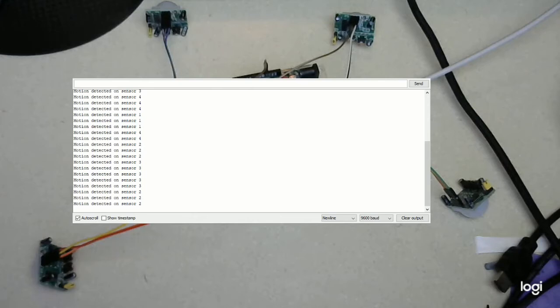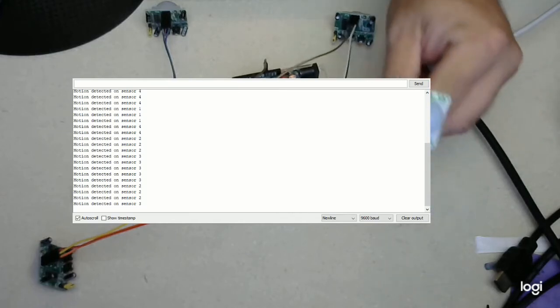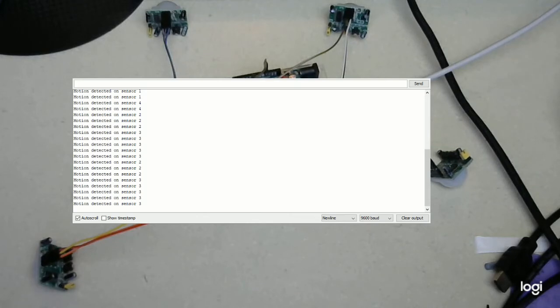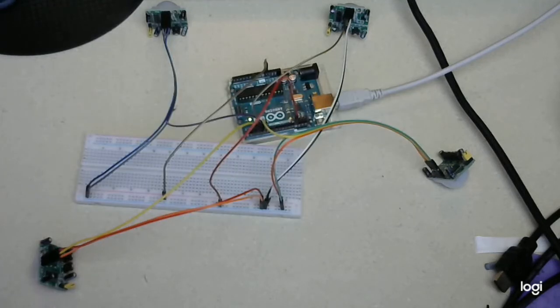And of course, when this is being actually mounted in, we'll have each location where we're detecting the beanbag be more controlled, so we don't get a lot of false positives. One way you can do that, because these do have Fresnel lenses on top of these sensors, is by putting PVC around it to block in any side view, and that just comes down with testing. But we know that the sensors now work, and so the next step is to connect up to the serial board, or the TTL to RS-485 conversion board, to make sure that the display board is going to work, and then finish out the rest of the logic.